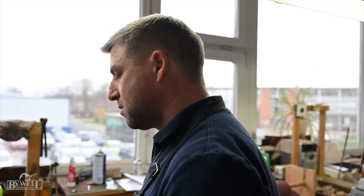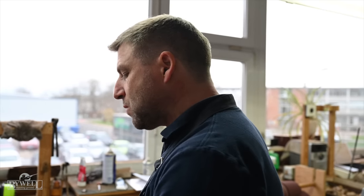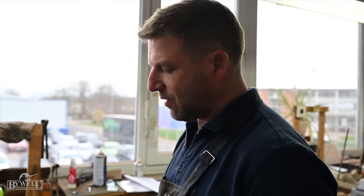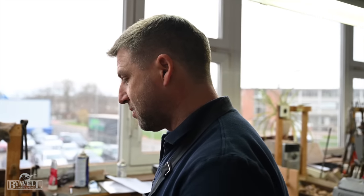The oiling process takes that long because you let it cure. The oiling process is roughly a week, but that's depending. The thing is, on that one, it's a nice small stock and you have a very fine grain in the wood, so that's absolutely nice. It'll fill nicely when you oil. Yeah, I think the customer will be absolutely happy with that.